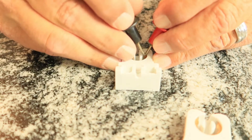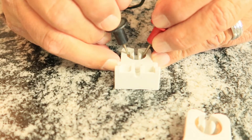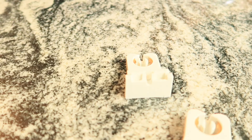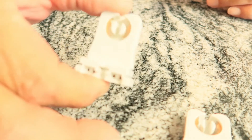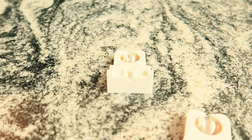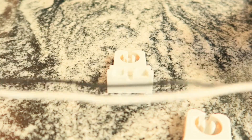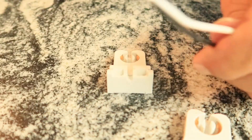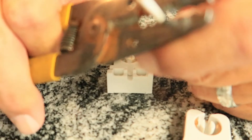If you don't get a tone — well, if I switch it over here you'll hear it — so that's just making contact on the same terminal. I'm pressing against these two terminals and I'm not getting a tone, which means these are non-shunted. That's perfect for what we want to do for a single-ended LED bulb conversion. Simply get a pack of tombstones — I'll put a link in the description — and when you take your light fixture apart you're going to have some extra wires, probably a black and a white. Strip that back about three quarters of an inch so that you have bare wire on both.